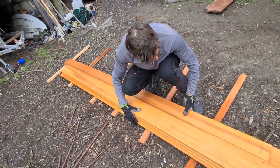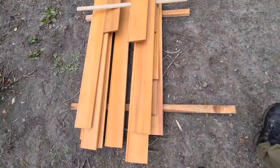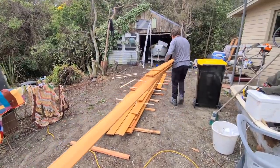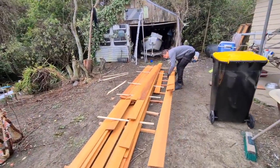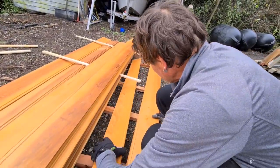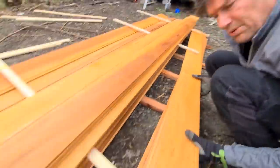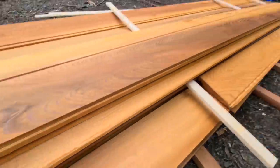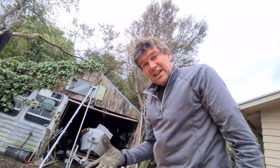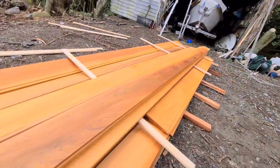These are the weatherboards. Beautiful. This side of the timber has basically been burnt by the machining, so it's not ideal for taking the stain — it doesn't allow it to go as deep because it's almost been burnt off and doesn't soak in as well. The bandsaw face is the face that allows the stain to soak in. That's what we need for protection — you need penetration.